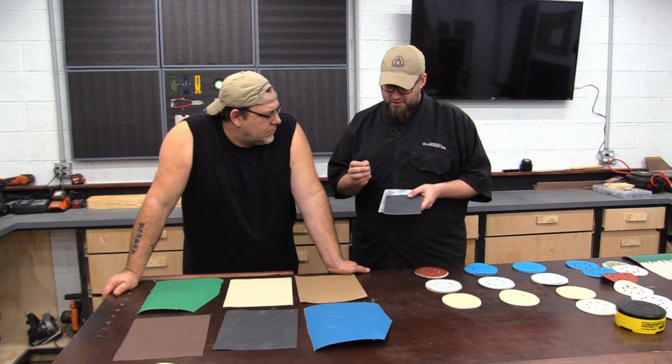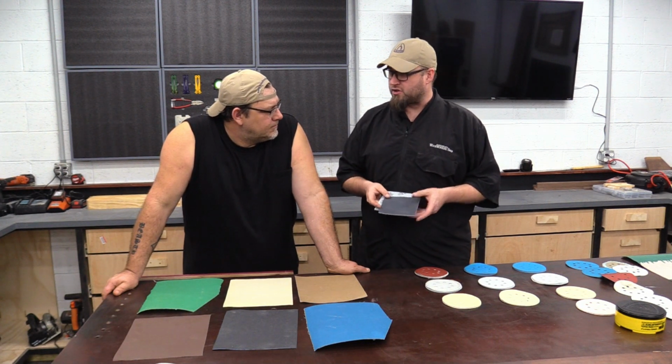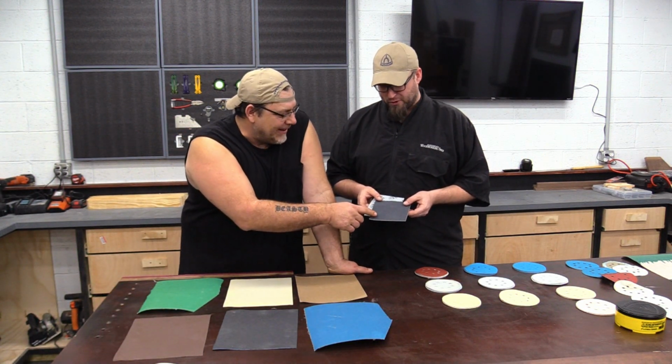What that fracturing does is that when it starts at 180, as you sand from this side of the board to that side of the board, it'll still be 180 at the very end. So it's called a consistent scratch. You said friable. I was kind of hoping you were talking about eggs and bacon, but unfortunately.